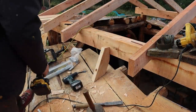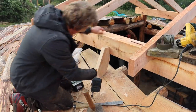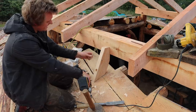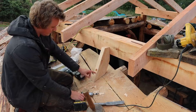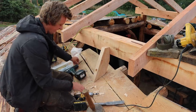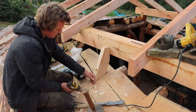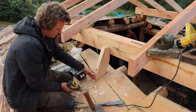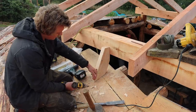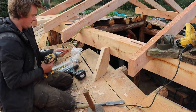Right, so that's what I'm going with. That's notched into there by about 15-20 mil, so that's not going anywhere. That'll be held in with one of these good quality lag fixings. It'll be kept dry so it shouldn't degrade. And then down here we're not in any kind of notch, so I'm going to use a big stainless steel fixing. That's not going anywhere, and it goes down into the rafter underneath. And then the roofing will also come up against here and be shuttered off with some cladding that's then fixed. So there'll be a lot of points more than just this. This is going to have weight bearing on it, turf bearing on it, and cladding and stuff that's all joined in everywhere else. So I think that is going to be very, very strong.